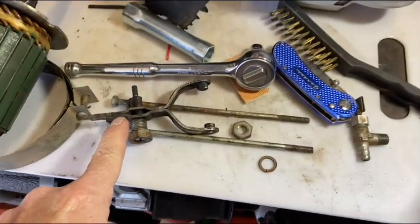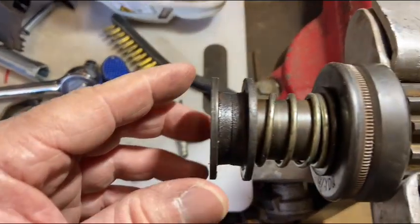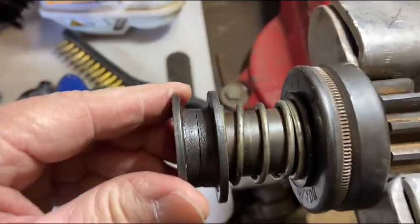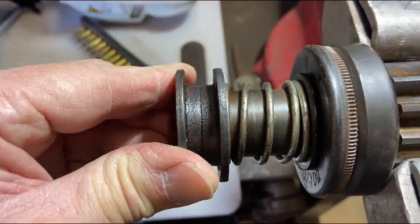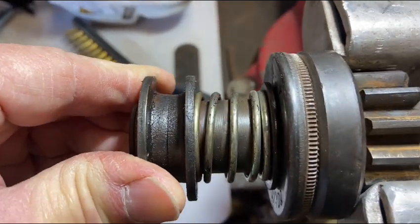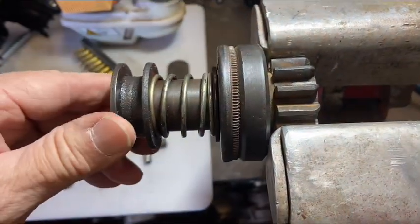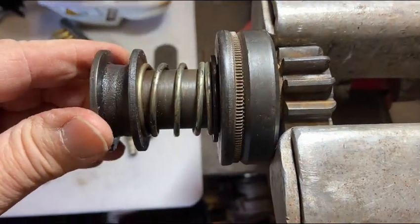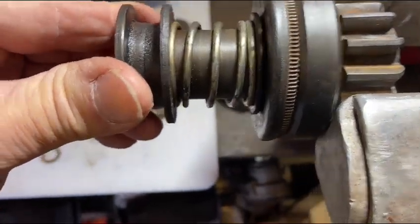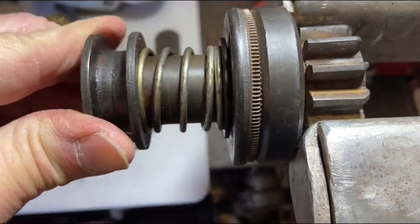Well, this fork being in there backwards could be the secret to our whole issue. Since it was in there backwards, when the solenoid engages, it forces this spring. This is some kind of sealed clutch arrangement. Anyway, that locks that and spins that gear, but it was slipping because there wasn't enough spring tension on it.